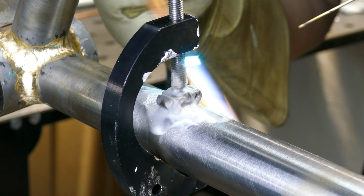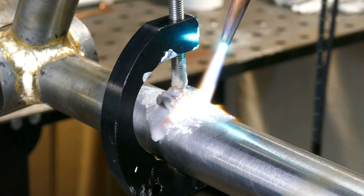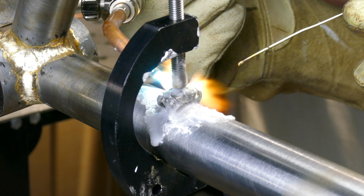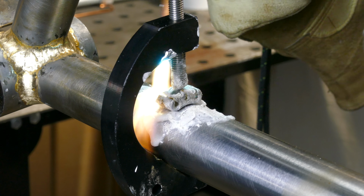Another unusual thing about my cable routing is that I use cable stops. I like the fact that less housing means a better lever feel, and I can easily get slack in the system for maintenance. I typically use double or triple stops in the down tube, which means less brazing and less braze-ons to fixture to the frame.